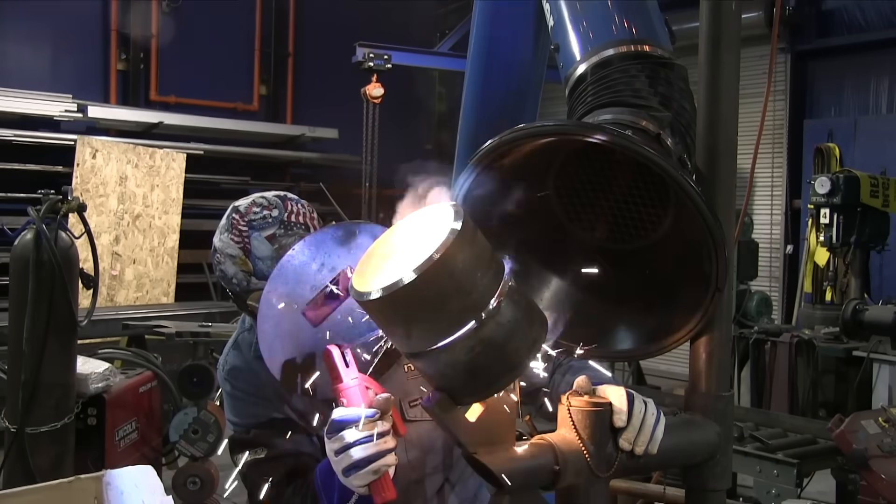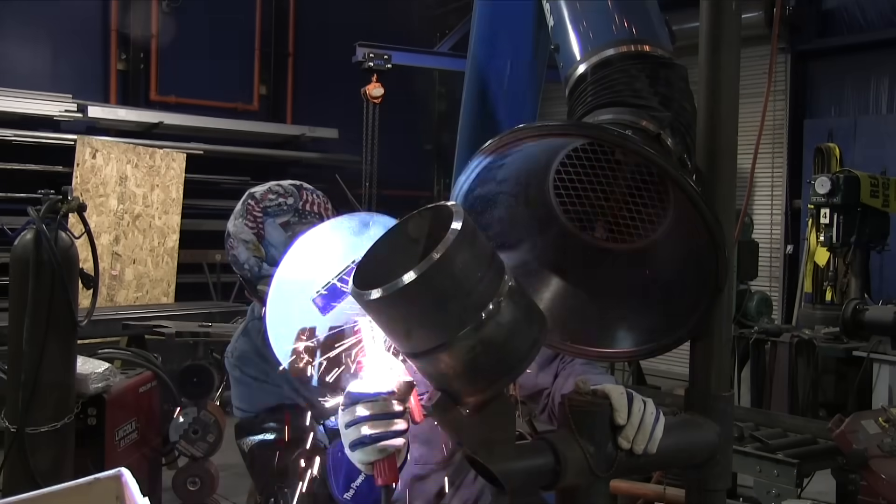It's just a little whip and pause here. There are a lot of techniques that work — you don't have to whip and pause. Some people like to just drag it in there, some people use a little bit of a circular motion. But this is what Andrew's doing today, and it seems to be working out just fine at 85 amps.